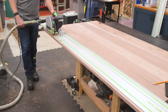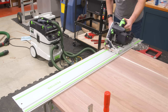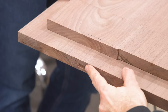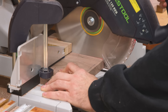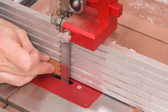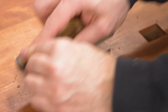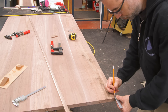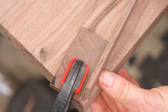The top was then trimmed to final dimension with the track saw. Here's one of the dangers of using the domino in a tabletop — sometimes you forget where your cuts will be and the cut exposes a domino. In this case there's no domino, but there is a domino hole. I show Matt how we fix stupid mistakes like this by patching it. We decided to add some gentle curves to the top, and those curves ended up completely cutting away the repair I did, so yay I guess.